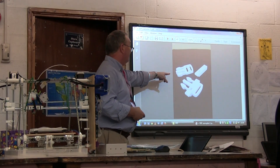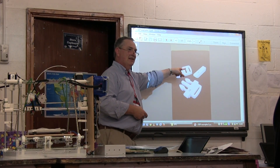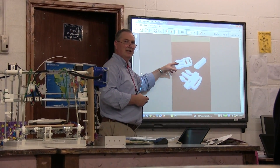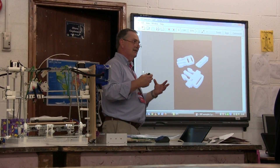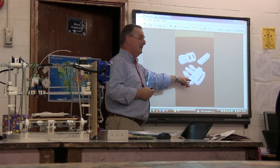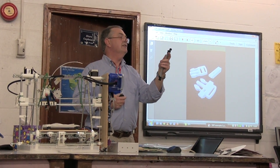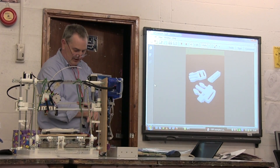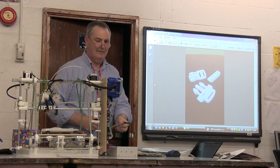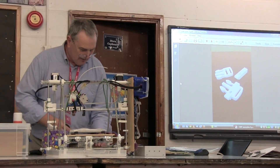This is a normal strap latch and a whistle. In the modeling software OpenSCAD you can combine these examples of solid geometry, manipulate them, and print the result. Here the whistle is the right size for an adult but it's too bulky and too big for a child — and you can't buy these smaller. The idea is that if you can model it, you can scale it down and print a smaller version.